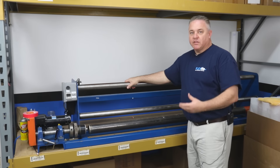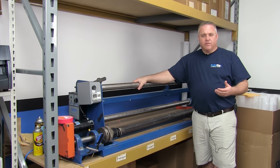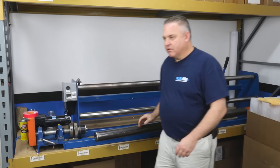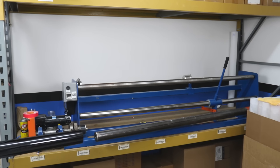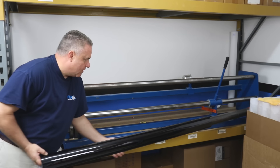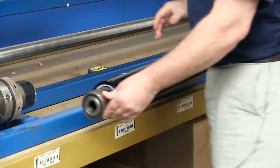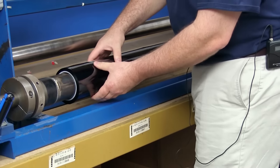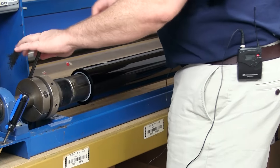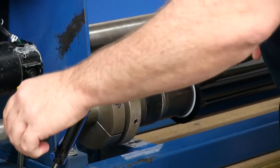In this scene we're going to actually cut a roll of film. I've got a 60-inch roll of film, it's 100 feet long, and I'm going to cut it at 24 and 36 inches. I'm going to put it on this mandrel and start the cutting process. I'm going to slide it on carefully and make sure it doesn't telescope, because that's what film does when you grab it and force it. Telescoping is when it shifts like this — not very fun.